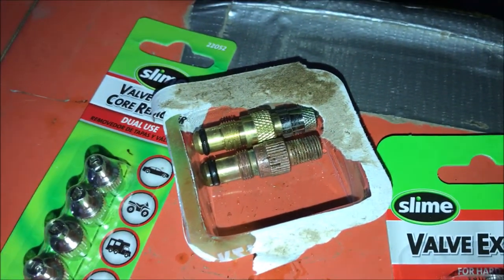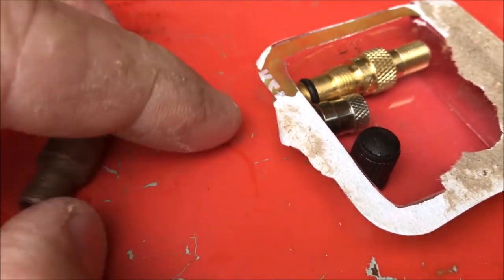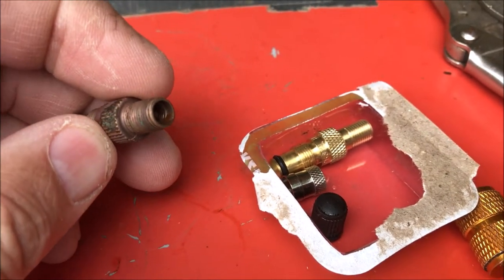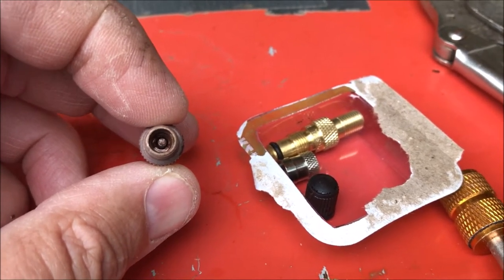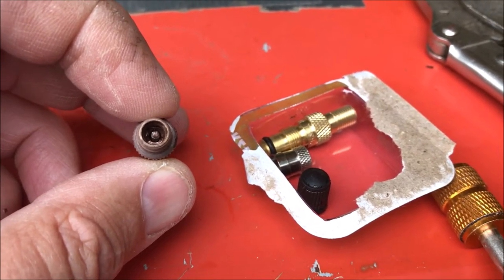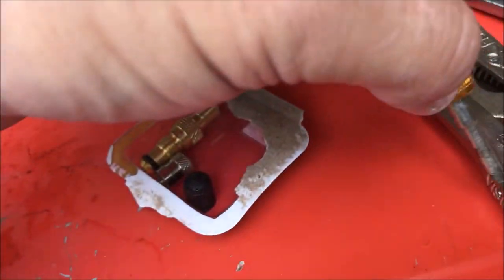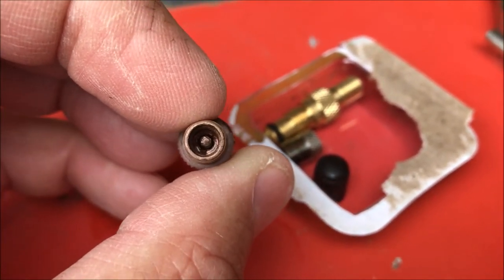It's the morning after. You can see the new valve there on the tractor tire. I've owned the tractor for about 20 years and never knew anything about valves in rear tractor tires until I had a problem about four days ago. When I went to check the air before going to help a neighbor, I pulled the valve stem cap off and it was just hissing, letting air out. I took my valve core removal tool and tried to take the valve core out expecting it to be similar to what's in a car.